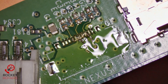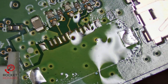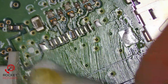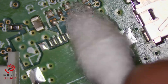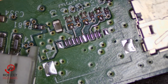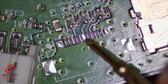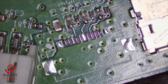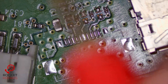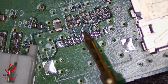There we go. You can see we have a couple of pins left on here. Has that ripped a trace as well? I believe it has — oh, the trace might still be there. I'm just going to give it a clean and see if it hangs in there. I'm giving it a good scrub and it's not coming off, which might be a good sign. Let's just make sure we've got continuity, because if so once the connector is down it should be okay. If the cotton bud caused this pad to come off I'd probably replace it, but we still have continuity — that is making continuity which shows it's got good strength.